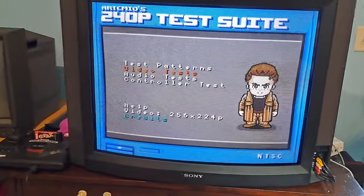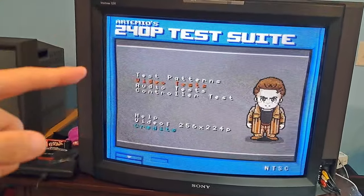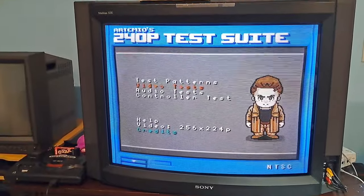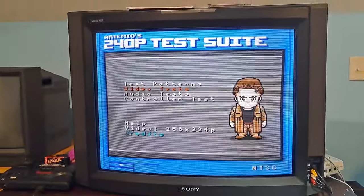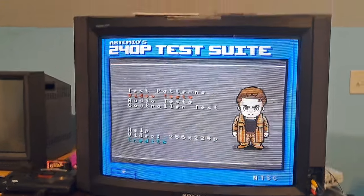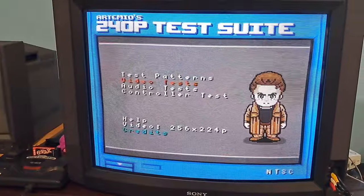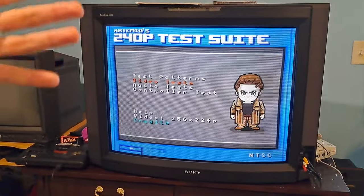What do I think about this set overall since I've been using it for a while? Personally, I actually don't like it that much — but that's not because of the image quality. I've had some issues with this set that I've been trying to dial out and it may end up needing a recap pretty soon. Being 25 years old, go figure, even though it's in really good condition. The corners are not the greatest. Sonys always seem to suffer from convergence issues — every Sony I've ever owned has had really terrible geometry and convergence that I've had to correct. On this one I'm not able to correct it exactly, as the image pins inwards a little on each side and there's not really a way to fix that. I think capacitors may be at fault.